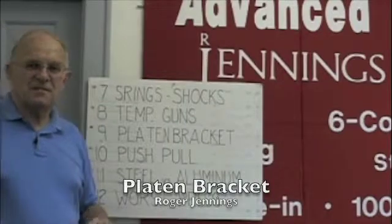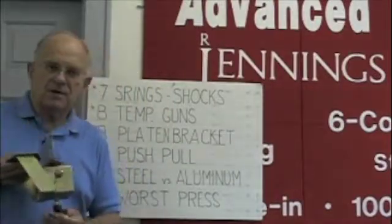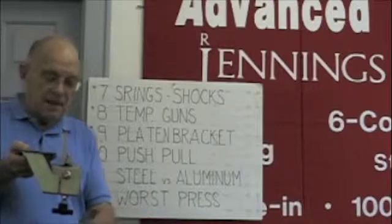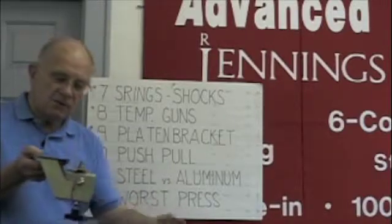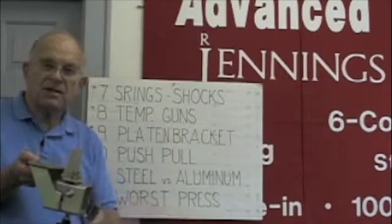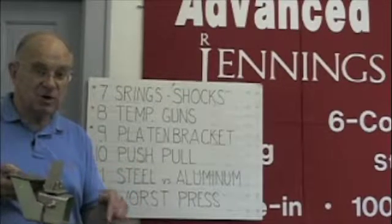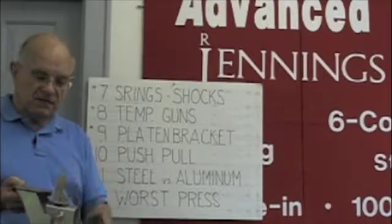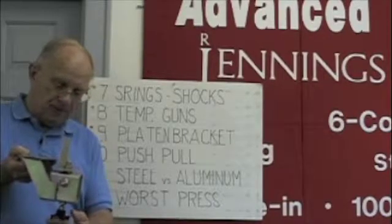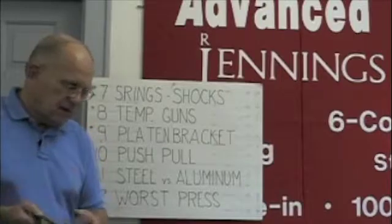Number 9: the platen bracket. A lot of companies have only one knob underneath their platen, and it's straight down. When you're loading your shirt, you have to get it over this knob, and when removing the shirt, you've got to get over the knob again — and that's the more critical time because now you probably have wet ink on the shirt. Some companies have a little fish gill to help you get the shirt on, but you're going to catch it when removing. Having this straight down makes no sense, and with only one knob, when you turn it, there's a torsional force that will skew your platen — not a good idea.